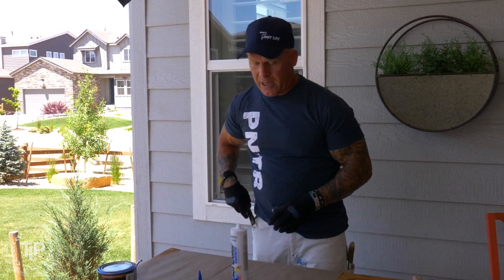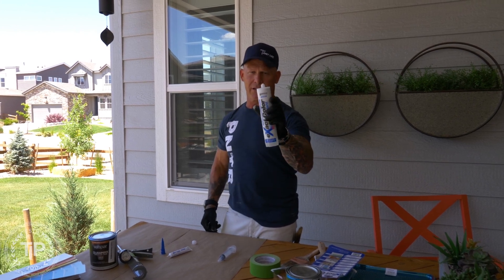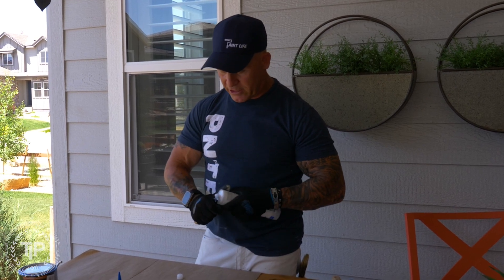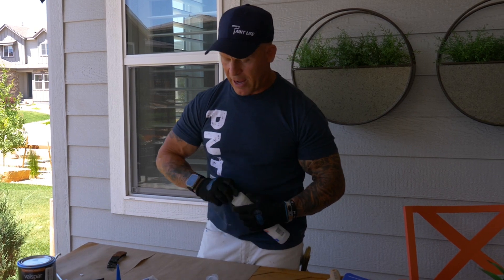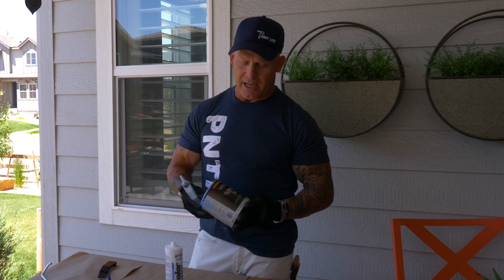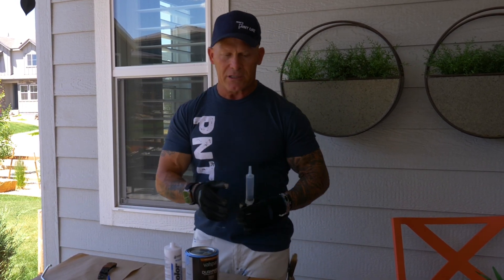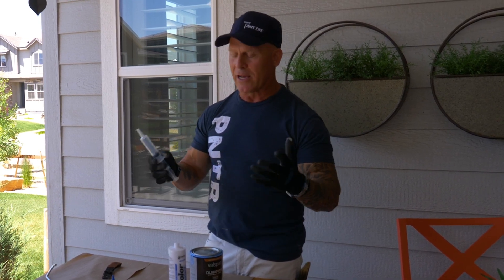Professional painters, do-it-yourselfers, anybody can do this. First, cut the tip off. A good pointer: don't cut so low that you take some of your threads, because your cap has a thread on it. Cut just above the threads with a nice sharp knife. Once the tip is cut, this lid threads on after applying your colorant. Now for amounts: typically you want to add 30 milliliters of paint. If you're using a paint with a lot of color — like reds or dark greens — the viscosity will be thinner, so add about 25 milliliters instead.